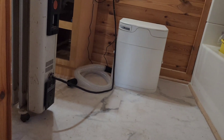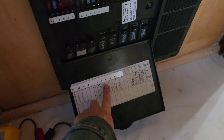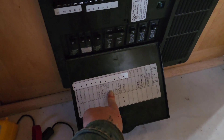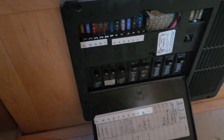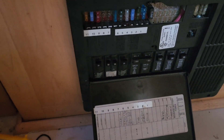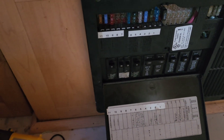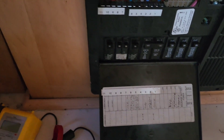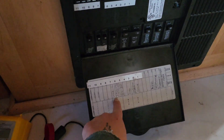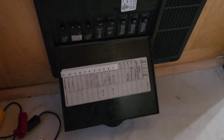Because I added the toilet there's an extra one — number four is where it actually controls the toilet and one of the other lights. I found out by pulling number five that it actually shuts off power for the kitchen as well, so I still have some identifying to do. At least I can get it labeled so I know which parts of the house shut off for each breaker and each fuse, and I'll get them labeled accordingly on the bottom to clean that up. The previous owner never even marked any of the 12V breakers.